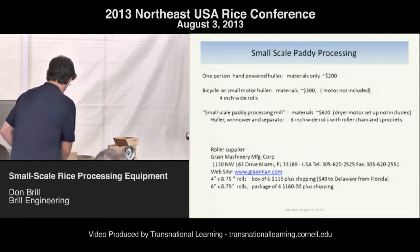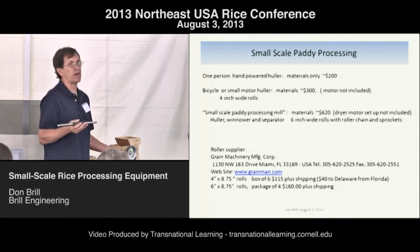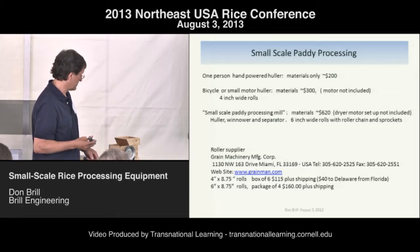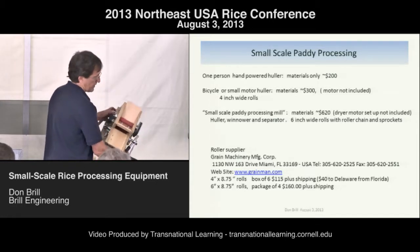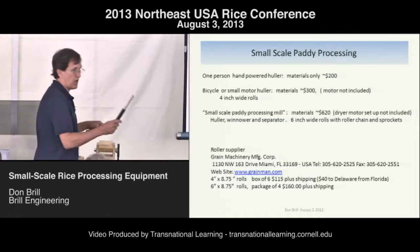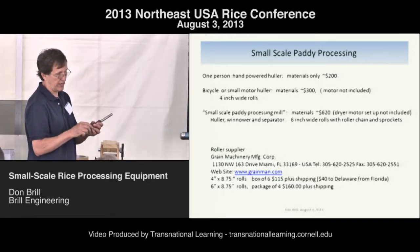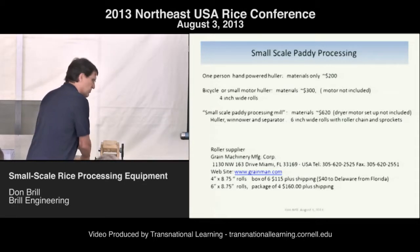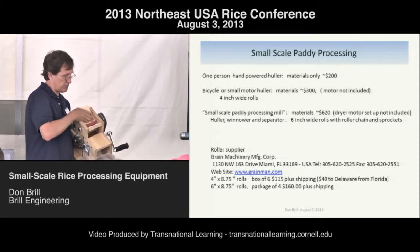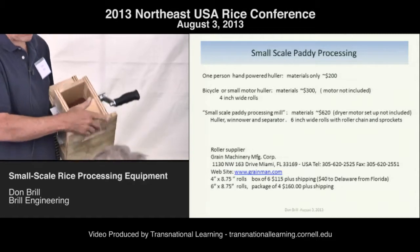So here's the feed system. For shafts, this is a precision shaft, but for hand hullers you could use 5/8-inch rod — get the one with zinc oxide coating, otherwise everything gets black. This is sandpaper glued with epoxy to a 5/8-inch clothes-washer hose. My rice is collected at the bottom, this pulls it up and into my slot — that's how I control the feed. Then it all just goes through my rollers and out the slot.